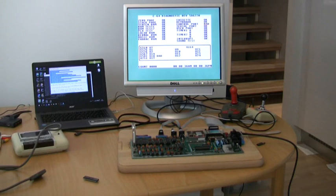Keyboard OK. Control port: Bad — U18. Bad. Serial port OK. User port OK. Timer 1 OK. Timer 2 OK. Interrupts OK. Control port: Bad — U18. Bad.